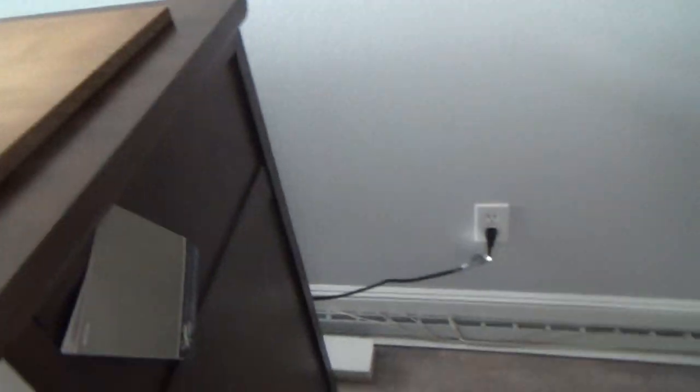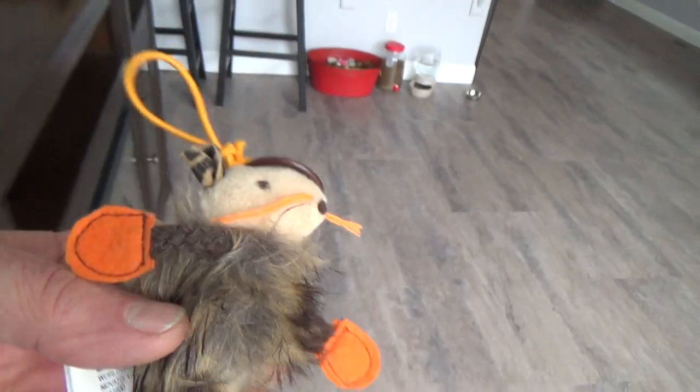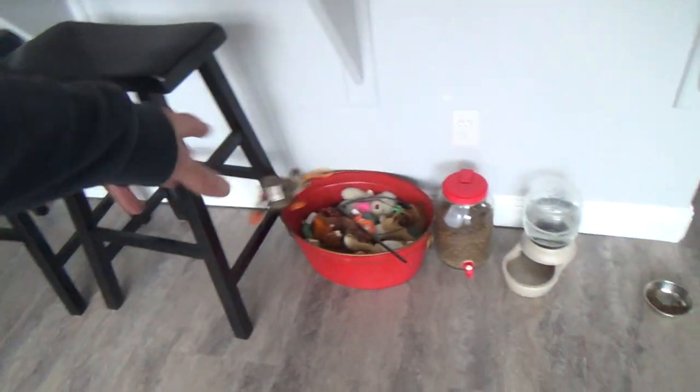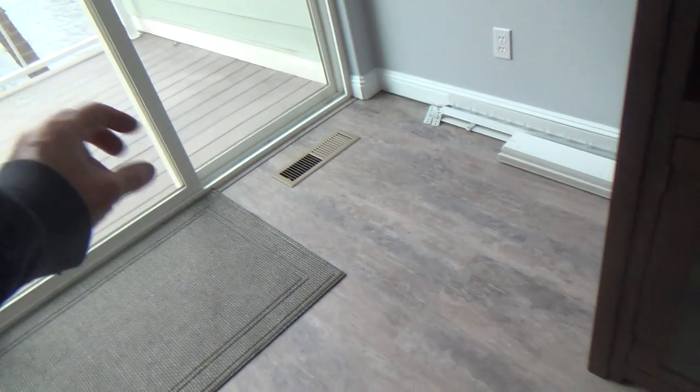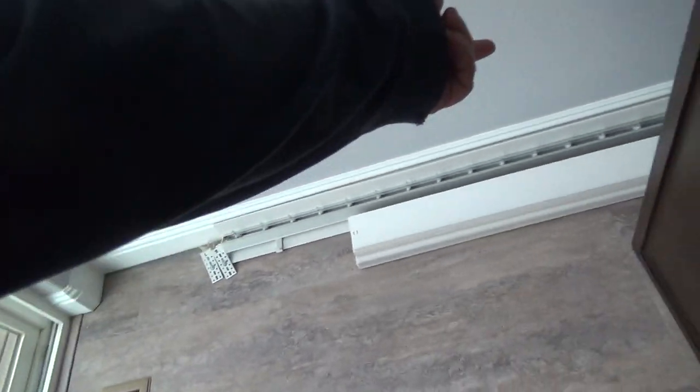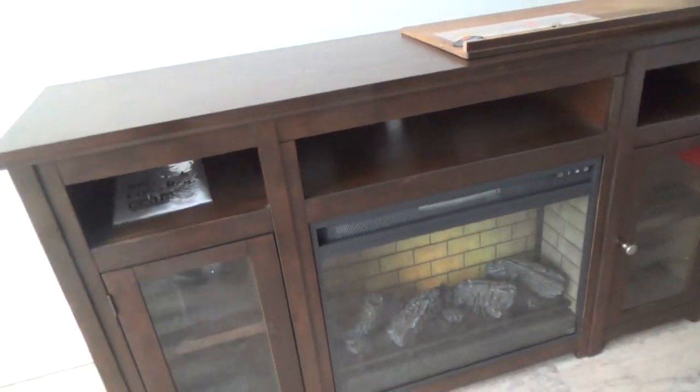I think I'm going to have to drill a hole directly flush with the baseboard, directly down into this floor, and then down. If you will recall, we put this vinyl flooring down here. The cat has her toys and she brings them around, sometimes she delivers them to us. Anyway — if you remember, we put this flooring down, so I'm going to have to use a quarter-round trim along here, and I could notch the backside of that where the wire is. Then the wire will just be hidden behind whatever we put up against the wall, and then it will come up.